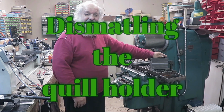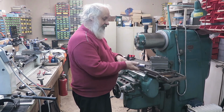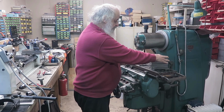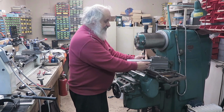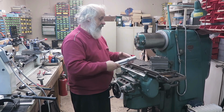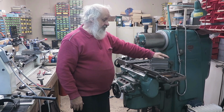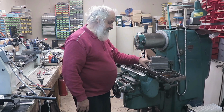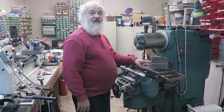And now the main event, so to say. This one now has the gear rack in it, and obviously there is a round hole, and it goes this way in. When it now goes in, it's a very tight fit. So, well, obviously we need a slot under here, inside, in order for it to be able to travel there. And now, since I don't have a shaper, and I don't have any means to mill, any means to machine that into a round hole, that's next to impossible for me.